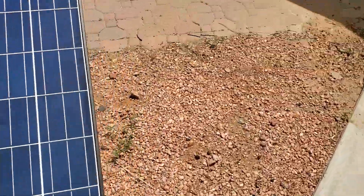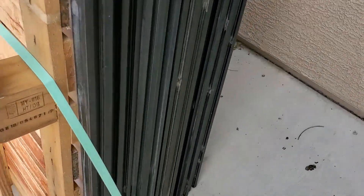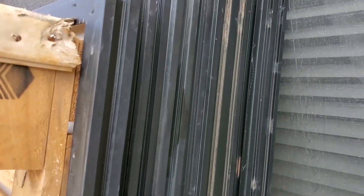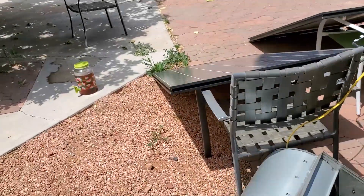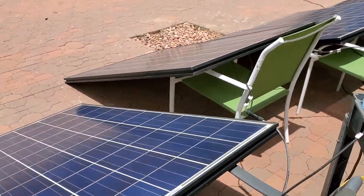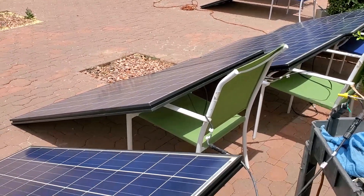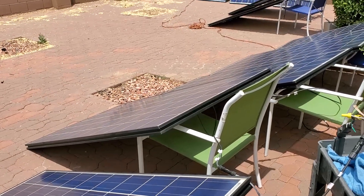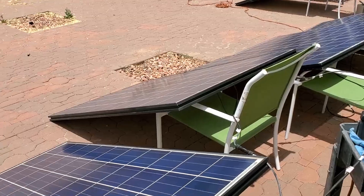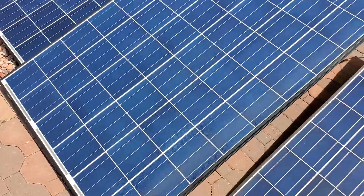With some load it's getting down to about 300, but when I'm trying to run that compressor hard it is definitely sagging the voltage down under 300. The sun's pretty much at high noon now — I have them all at funky angles but I think it's hitting good enough that I'm probably getting close to full output for my test. So I have those 10, and I got another stack of 10. I think with all of them I should be able to run a 3-ton compressor no problem, maybe even a 4-ton. I was thinking running two 1-ton mini splits off of my gazebo panels — or solar panel gazebo — that I'm setting up here.